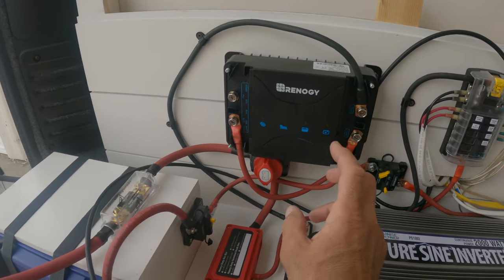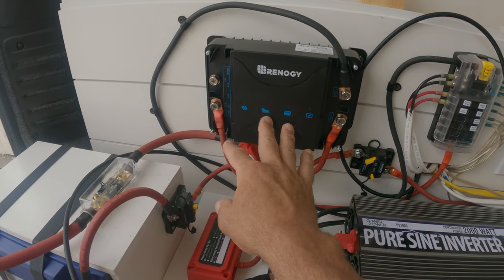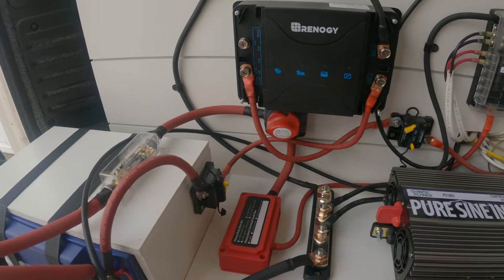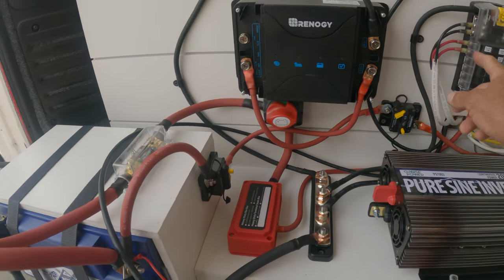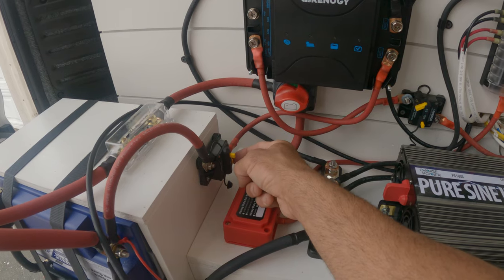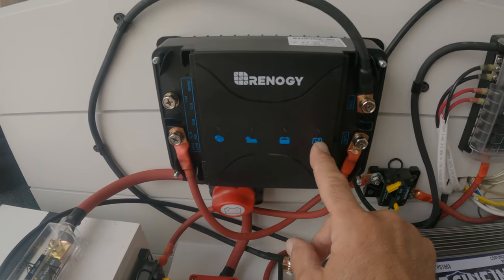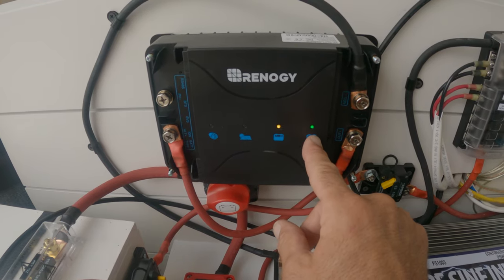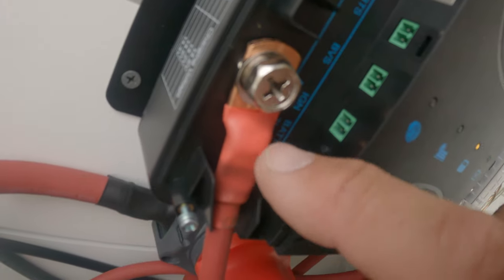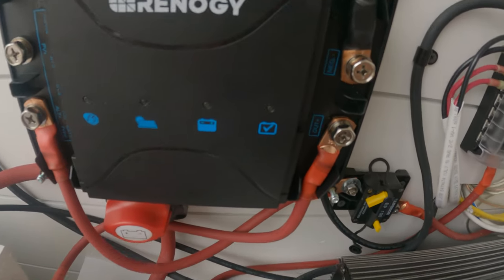Before you connect the solar panels — that's the last thing you're going to do — first we're going to make sure the battery's connected and working properly on the charge controller. I'll flip this switch here and that's going to supply power. I checked it out — it's already working. For the charge controller, when I flip this breaker it should power the charge controller. Let's see if it works — nice, very good. This is showing the battery has a normal charge. This green light needs to change to a blue light since we have lithium batteries — you can do that by pushing this little button on the side.